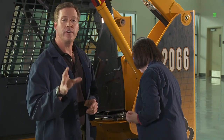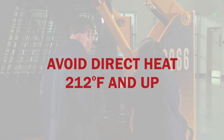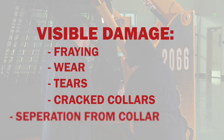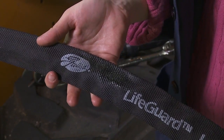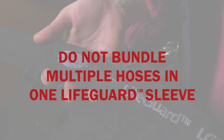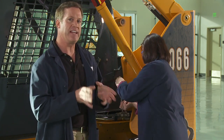Here are a couple of final precautions. The lifeguard sleeving system is not designed as an abrasion guard. Be sure to avoid sharp edges and abrasive contact with the sleeve. Don't expose the sleeve to sources of direct heat with an ambient temperature above 212 degrees Fahrenheit. If there is any visible damage such as fraying, wear, tears, cracked collars, or the sleeve tearing loose from the collar, the sleeve needs to be replaced. Also, if you see any visible oil saturation on the sleeve, replace both the sleeve and the hose immediately. Do not bundle multiple hoses within one lifeguard sleeve, as this will have a negative impact on the sleeve's performance. Thanks for taking the time to understand the Gates Lifeguard Sleeving System, and thank you for choosing Gates.